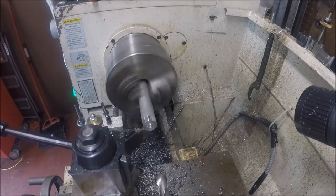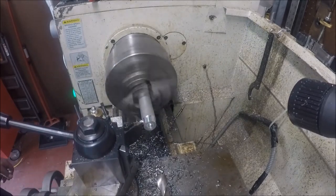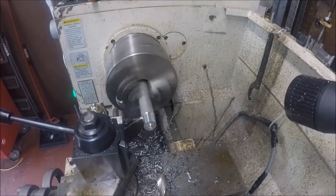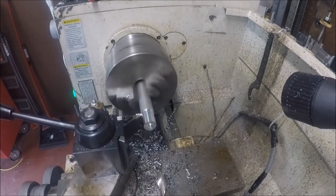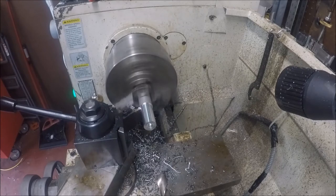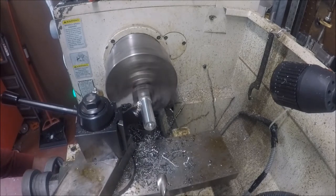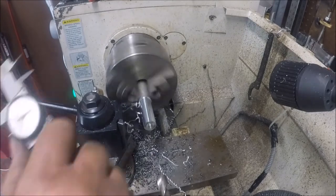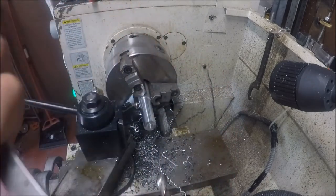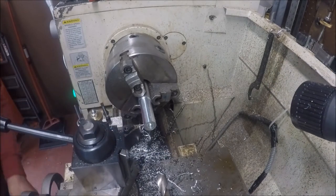Okay, here it goes. I want to see how this tool will go along. It's not the tool, but the chip break rod. I think when I bought these, they were finishing tools, and realistically, on my lathe, that's what I need to be buying. But a lot of my inserts come off of eBay. This is a house brand Grabber's insert. I have probably a full-blooded Chinese special. Let's just see. 9-10. So we like about 20 thou for finishing pass, which is good.